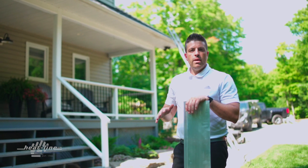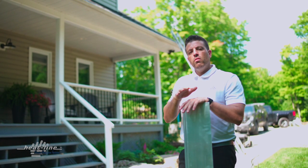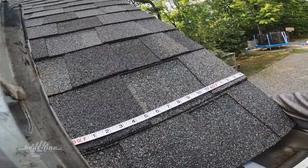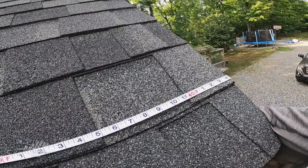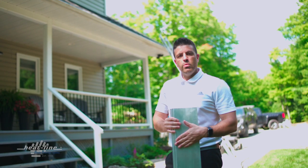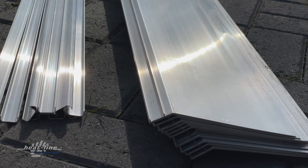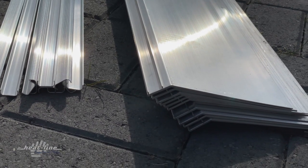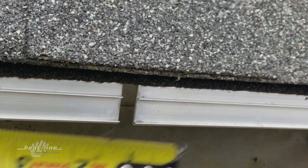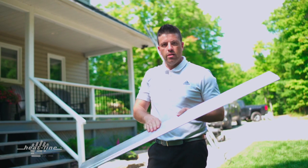Next, we want to get the measuring tape out and actually measure the length we have here. We've already done that in advance and we have a little over 40 feet — about 40 feet 4 inches — which is almost perfectly the exact length we need. We need 4-foot edge cutters, 10 of them, with approximately a quarter-inch gap between each one. So we're going to use 10 edge cutters to cover our 40-foot length.